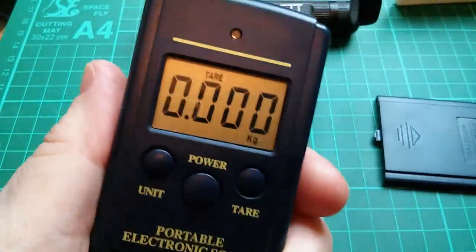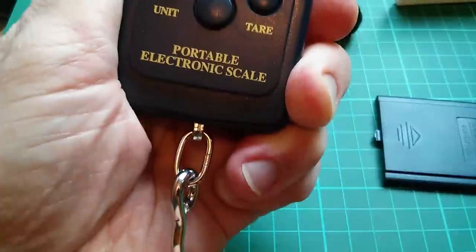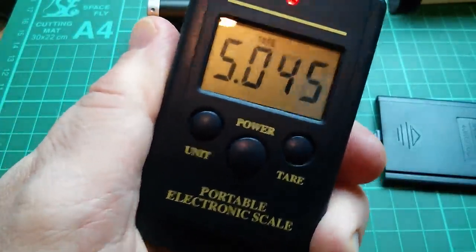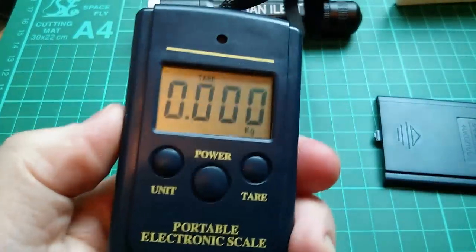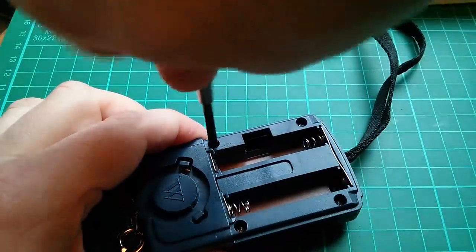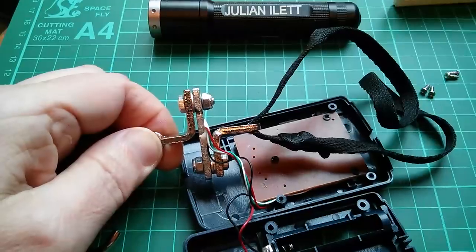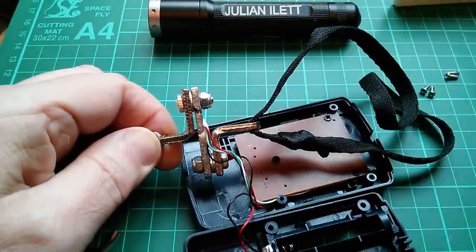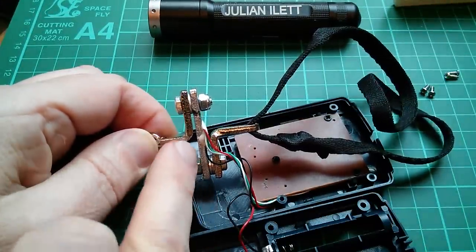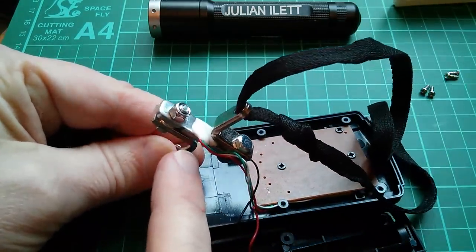Let's come out of temperature measurement. So if I pull on that — I'm pulling that quite hard now. It measures up to 40 kilos, so I'm quite interested to see what that looks like. Four little screws holding this together. Here's the mechanism — it's just two L-shaped pieces of metal bolted to a central piece of metal, and on that is glued a strain gauge.